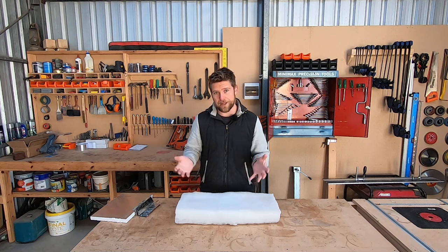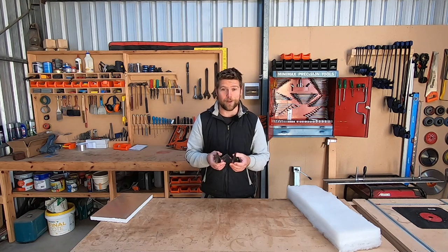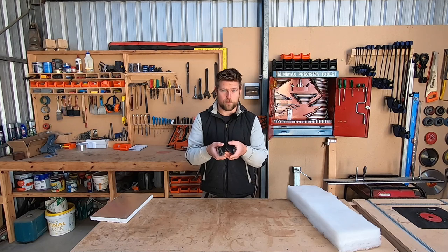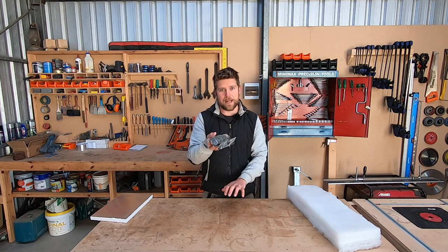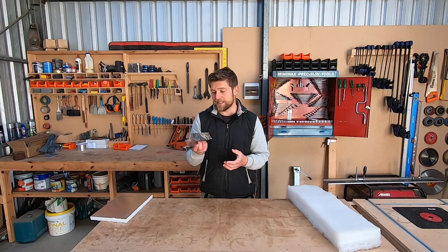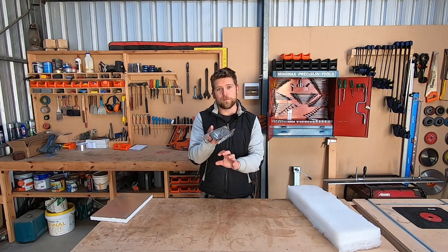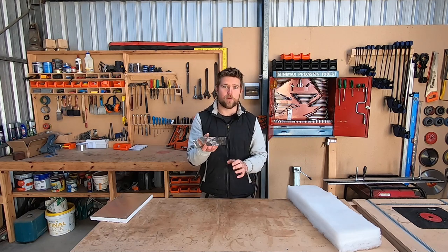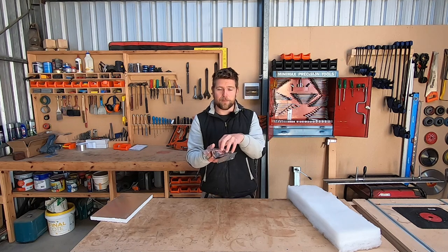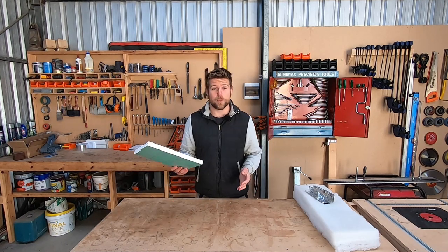Bulk fill also doesn't provide a moisture barrier, and you need something to support the batts underneath — usually a sheet metal pan or vermin mesh — which means a lot more work. The next option I looked at was foil-based insulation. This works by reflecting radiant heat, keeping heat away in summer and reflecting it back into the house in winter. The problem is it's effectively useless when there's airflow, because the airflow moving over the foil draws heat away rather than reflecting it.